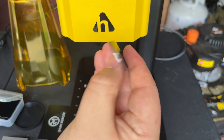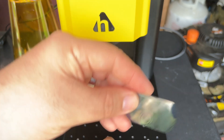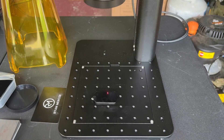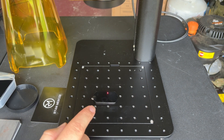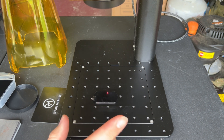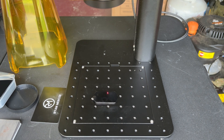Now let's try doing the same thing on one of these stainless steel dog tags. We're going to shrink it just a little. I've actually tested something on this before, so I know the lighting isn't the greatest — we've got those Canadian wildfires and haze for days down here in Indiana, but in future videos I'll have a much better setup. I'm trying this at 750 speed, 37% power, 45 kilohertz, 37% power max, and 0.0250 interval. Don't know how well this is going to work.